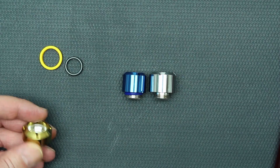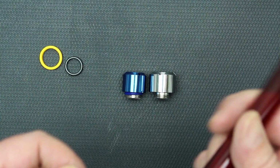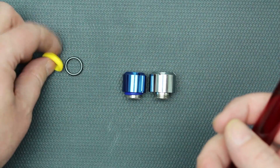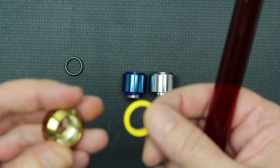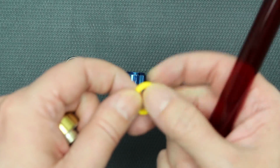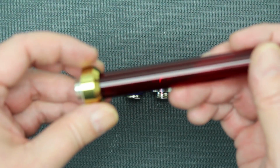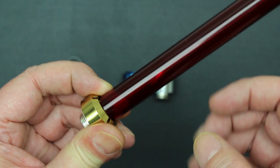The way the originals worked, and the way most push-in fittings on the market work, is that they use a rubber seal, an O-ring inside there, that forms a seal on the side of the tube. And then there's a rubber expansion band. What happens is you put the tube inside, and as you tighten down the compression ring, the band squeezes down on the side of the tube. What that did was basically create a seal, and then gave it a little bit of resistance to pull out.